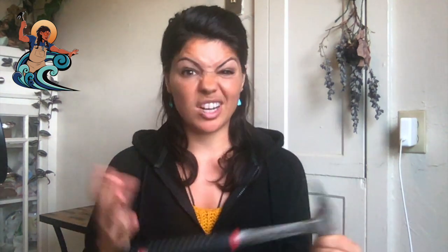The things you're going to consider when choosing the right material for your hammer are cost, durability, and comfort. Ultimately it comes down to your preference. The most common materials at the store are wood, fiberglass, and steel. Wood handles tend to absorb the most shock from the metal hitting the nail, reverberating into your arm — they're going to be the most comfortable for most people, but they'll wear out. Steel hammers are a bit heavier and absorb way less shock, but they can last a lifetime. Most steel and fiberglass hammers have some kind of rubber grip to try to compensate.